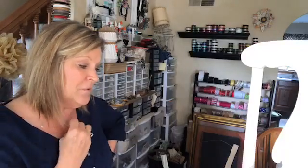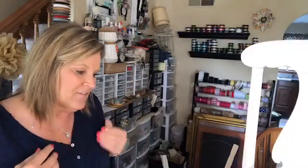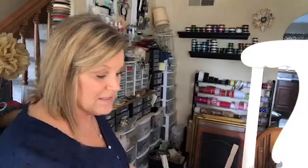But anyway, I think I'm gonna go with the oil, and I'm gonna hit it wherever I see the bleed through. So instead of painting the entire thing with oil, because I hate working with oil, it's just sticky, it's thick, it'll gather sometimes and sink down on you, and I'm just not a fan of it. But you know, when you need it, you need it. So obviously the white latex primer is not killing this bleed through.